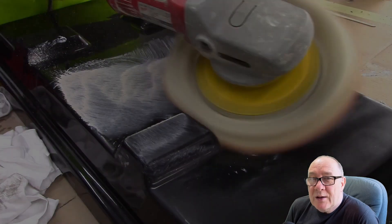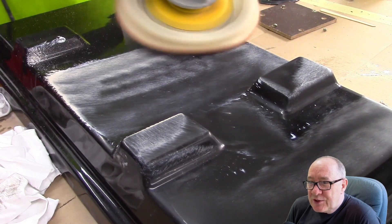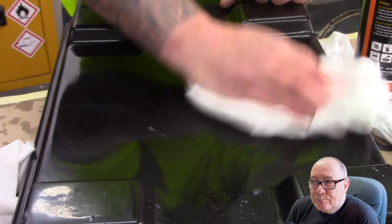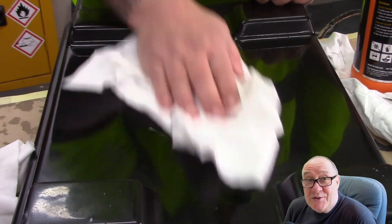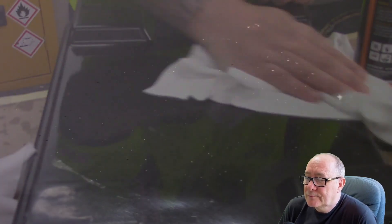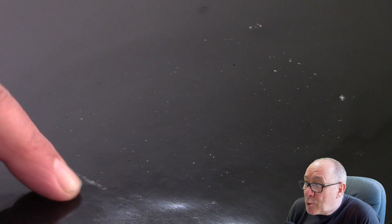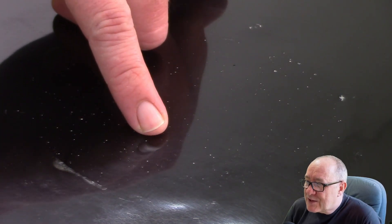Here we've given our panel a good polish with Farecla G100 compound followed by Farecla finish compound and we should end up with a really good shine. But you can already see some of those imperfections we just mentioned. Close up you can see how the original gel coat surrounding the repair wasn't thick enough to stop us hitting the resin layer underneath, and as the white polishing compound has filled the micro craters you can see them quite clearly. Once washed out the craters will be less noticeable, however they'll be more visible once dirt gets into them — so painting afterwards might still be your best option for a cosmetic repair.